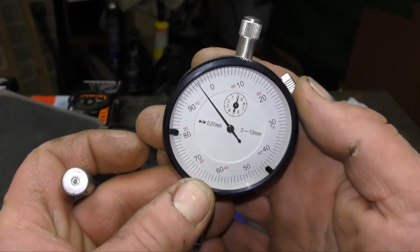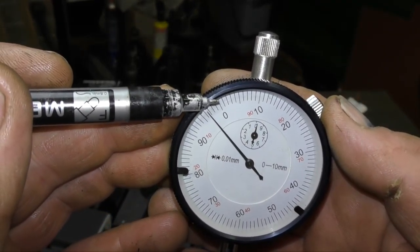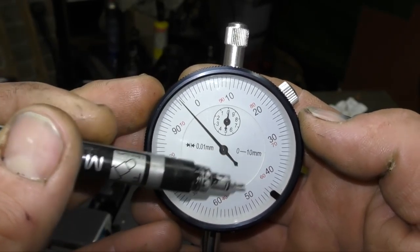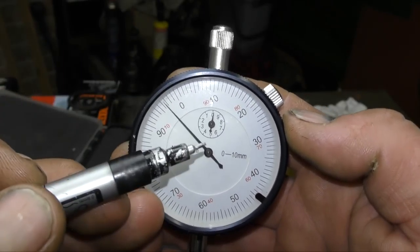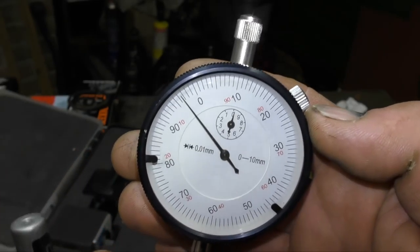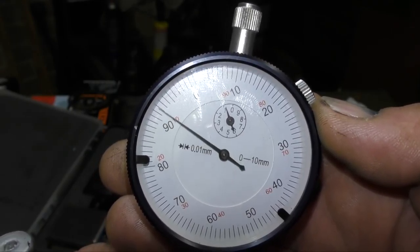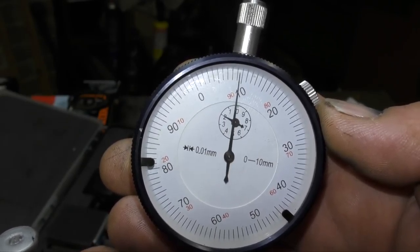What I'm going to do here is explain the dial gauge, the DTI. Basically, each one of these increments is one hundredth of a millimetre - so that goes 10, 20, 30, 40, 50, 60, 70, 80, 90 - that's 0.1 of a mill, and each one of these is one mill increment. So one complete revolution of the needle around the dial will be one millimetre, and then we can go around again.